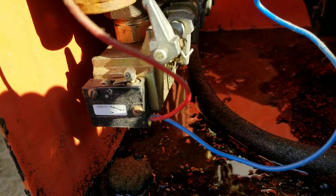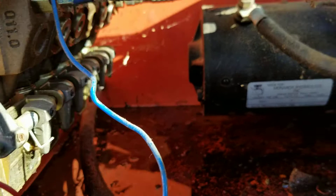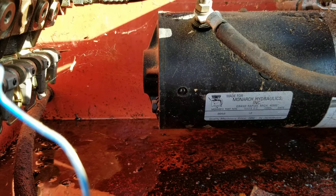So I may have a bad micro switch. The problem with the hydraulics was they were just super slow, almost like the motor was grinding. I had to tap on the main motor and that seemed to help. The primary hydraulics that would not work with any consistency were the log dogs and the log turner.